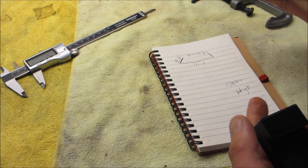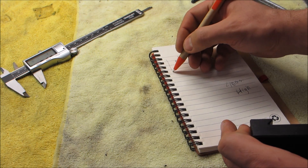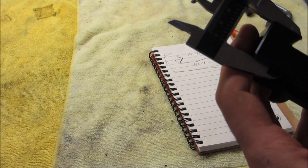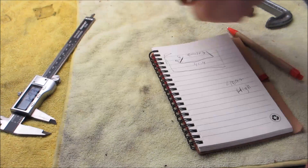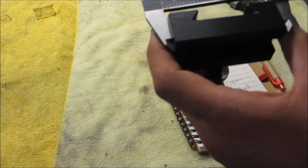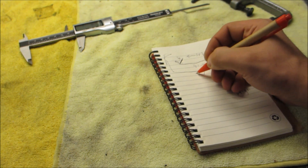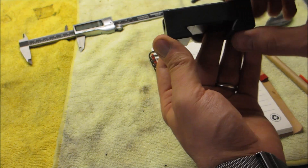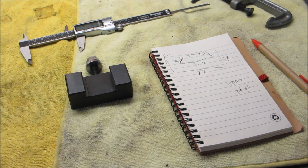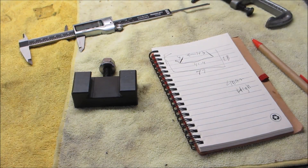I have chicken scratch writing, but that's what scratch pads are for. The width of this whole thing - it's actually nice to know - is 27.64, so we'll call it 28, rounding to the closest millimeter. And 76.5, so we'll call it 77. We have this profile all measured out. Next I'm going to show you how I'm going to design this in SketchUp, because for something this simple I don't really need to go through Fusion 360.